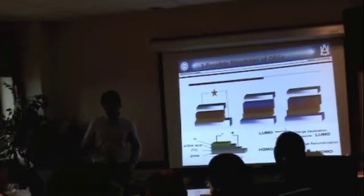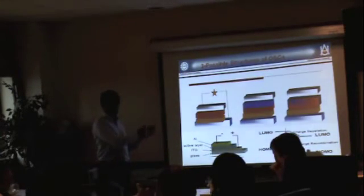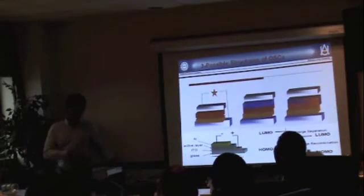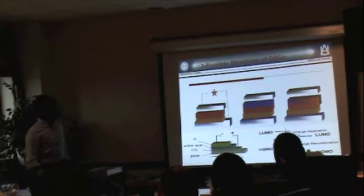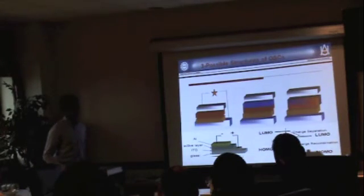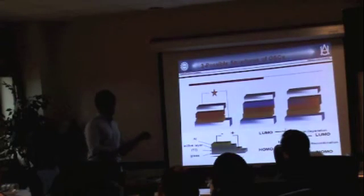In fact, these are nothing but the band gap for organic electronics. Like we have the band gap structure for inorganic semiconductors, these are like the band gap structure for organics. LUMO, that is lowest unoccupied molecular orbital, and HOMO is highest occupied molecular orbital. This model is similar to the band gap model but an organic version.